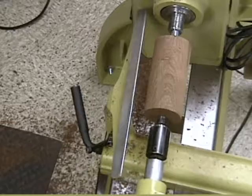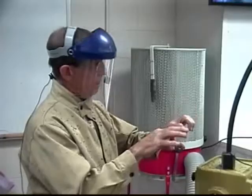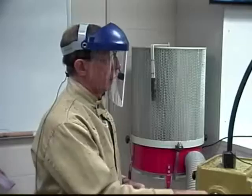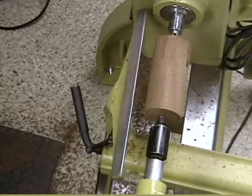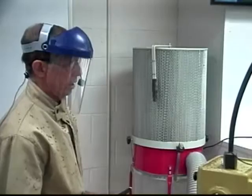You don't turn a tenon on here. Like the 8-inch, you've got your 10 or 11-inch blank, and you turn that tenon to fit the inside. They use their plastic insert as your tenon. So you don't have to do that on this one. So it actually makes it a lot easier. It's not so fussy. You just don't want to sand once you drill your holes because their parts don't fit real snug. You don't want to make it any bigger than you have to. So I'm going to turn a tenon on both ends of each blank so I can turn them around and drill them.